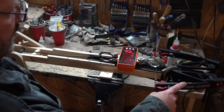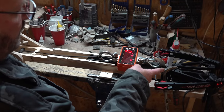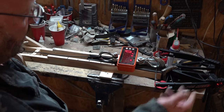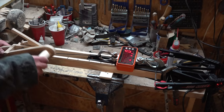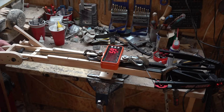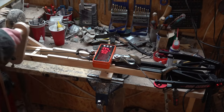Now, as you can see, I clamped in the throwing arm of the Siege, and I have to keep this with the clamp just because the pins don't fit. But anyway, it's holding now. And now I can start measuring it. And now if you wind it back, you see that it's actually jumping up quite quickly. So this is just a quarter draw and it already has over 90 pounds. So, and this is getting harder and harder and harder